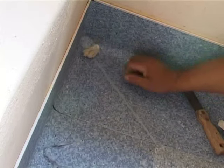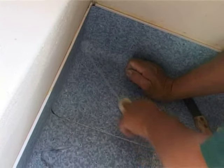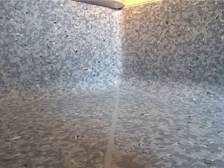Once sanded, the join needs to be carefully solvent wiped lightly only on the weld, and then a light coat of porous sealer applied with a soft cloth to prevent the weld from getting dirty in the future. The final result is a delicate and cleanly installed corner.